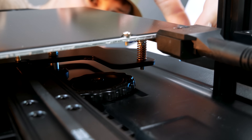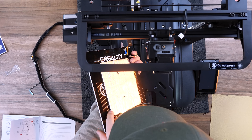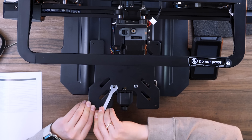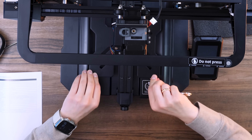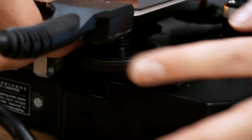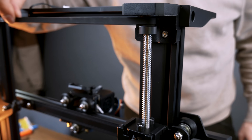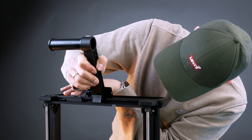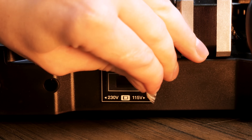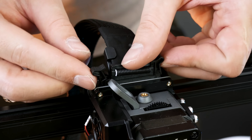The bottom of the build bed looks like this — a heating platform with a small thermal barrier. We need to adjust the platform itself so that it doesn't play, and pull the strap up to the right position. Then set the surface back. I noticed an interesting feature: the vertical screws that control the Z-axis are connected by a belt and they are synchronized. Next we install the filament spool holder. Don't forget to switch voltage depending on your region. All that remains is to connect the electronics.